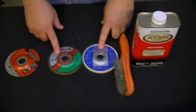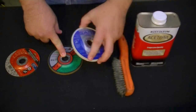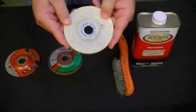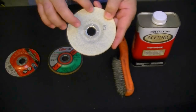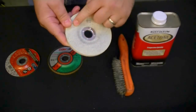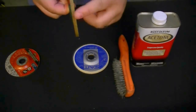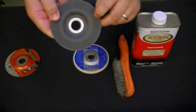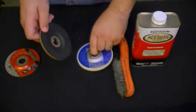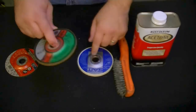What we have here are two specialized aluminum grinding stones for a four-and-a-half inch angle grinder. This one is a buttery yellow looking stone — and what you feel along here almost feels greasy. It's got wax impregnated into it to prevent the aluminum from loading up. Along the edge you can see the same butter color. This second one has a slightly darker surface on the initial layer, and it's actually a little bit cheaper. The first stone is about $15 if you get a good price, and this one is probably about $8 or $9.